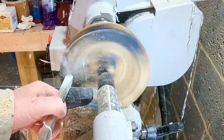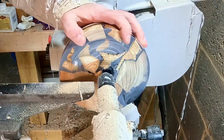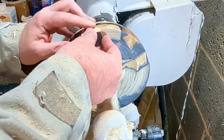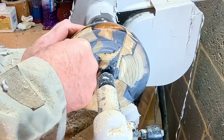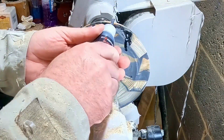Part of one of the offcuts had broken away from the rim, leaving a fairly big gap, but luckily I found the missing piece under the lathe, and with a good application of black star bond and an activator, I was able to effect a repair. Then I cut the waste away with a pull saw, and normal play could continue.